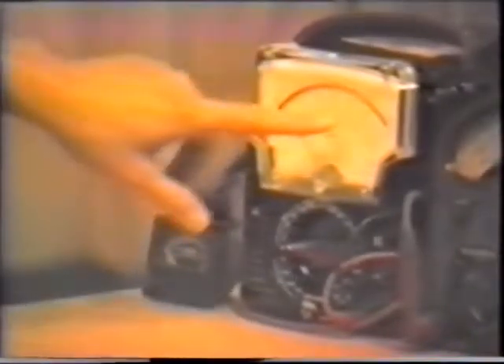For each 50 millivolts on this meter — which on this scale is 300, 200, 100 millivolts — when it indicates this much on this scale, that will be equivalent to 1,600 amperes, and this will be 3,200 amps, 4,800, and so forth. The product of the current times the voltage is the power being withdrawn from the machine — volts times amps.